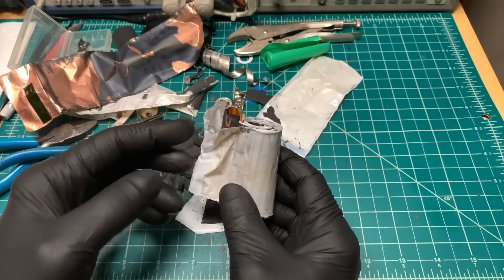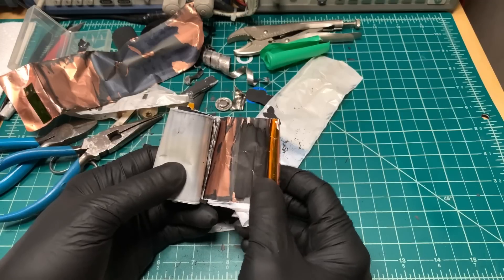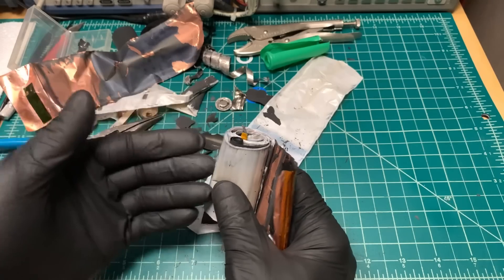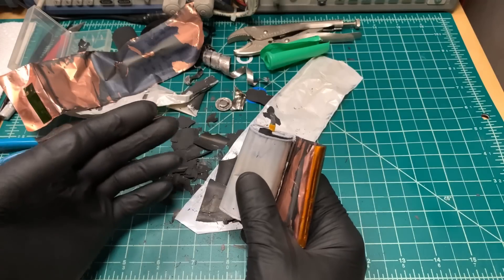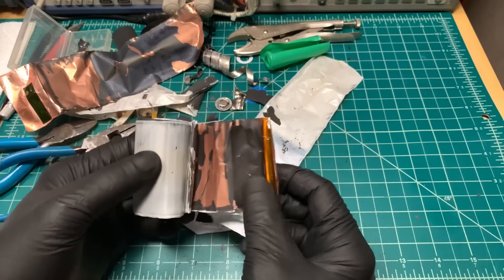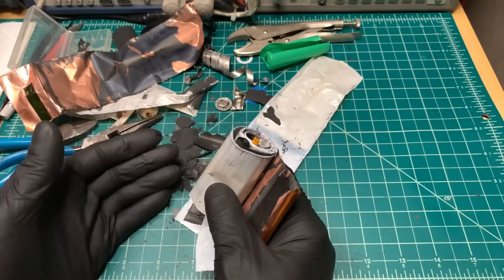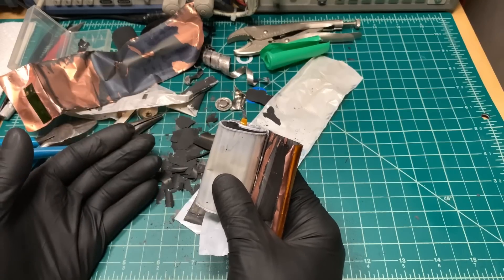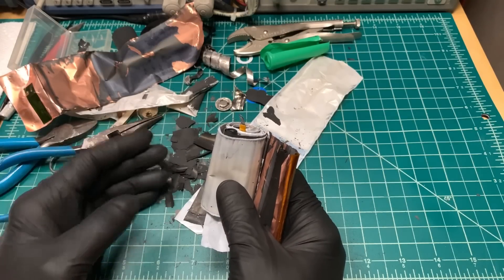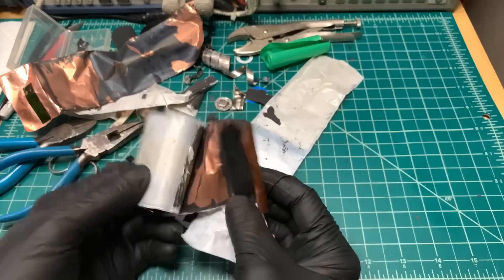That's really the hallmark of battery design — you're designing for certain markets and balancing trade-offs. For something like power tools or electric vacuum cleaners, you can have higher current handling with thicker foils and lower capacity. On the other side of the equation, maybe power banks, electric vehicles, energy storage — that's where you want capacity most of all: very thin foil layers, lots of extra goop, longer rolls, higher capacity. But there are no miracle batteries — you can't get a 3,500 mAh, 50 amp 18650. There will only be little improvements here or there. So buy from known reliable suppliers, and don't believe the hype for 50, 60, 80, or 100 amp batteries. They just don't exist because of too many trade-offs.